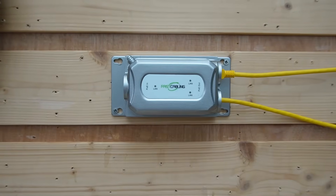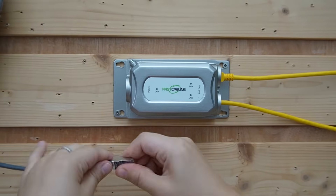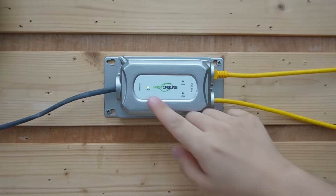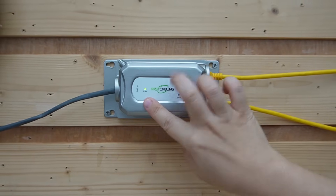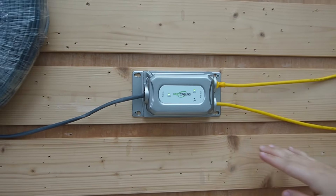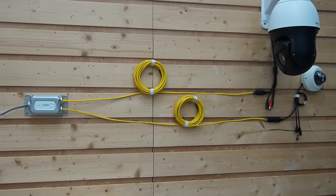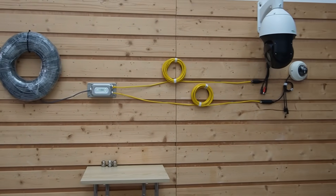Then we're using a 100-meter Ethernet cable connected to the PoE output port to send both power and data to our 1-in, 2-out extender. For outdoor runs, we have to use the provided cable gland and nut, and use the wrench to fasten it. Then connect the 100-meter Ethernet cable to the PoE input port of the extender. Once the indicator lights are on, we branch the 60-watt high-power port to the PTZ and the 30-watt standard port goes to the dome camera.